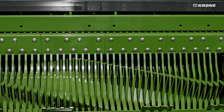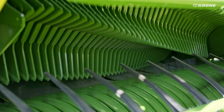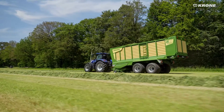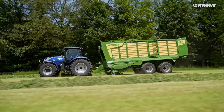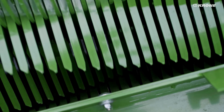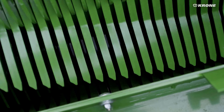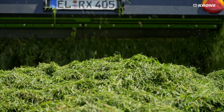The entire 195cm of conveying width ensures perfect utilisation of the loading space, and the rotor diameter of 88cm guarantees an enormous output capacity for these harvesting professionals. The shear cut principle is well known and standard for Krone. The blades, positioned on the conveyor holding surfaces, ensure an exact pulling cut, which saves energy and preserves forage texture.